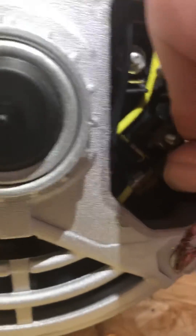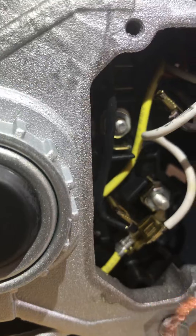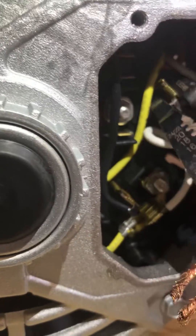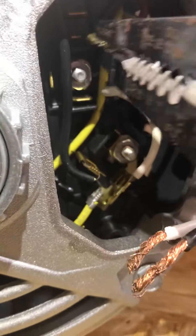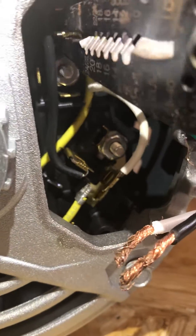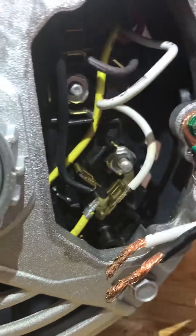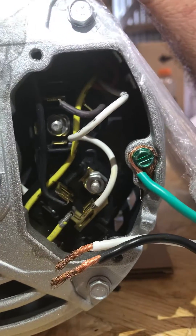Move this down here — it's the only available copper connection down here. Then you take your brown wire that's right here and you move it to this leg over here where the white wire was, and you just went from 220 volt to 110, so 115. That's how you do it.